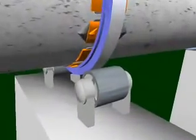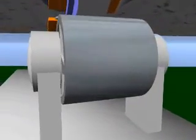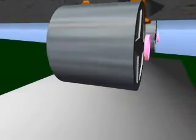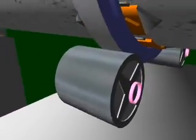As the kiln rotates, the tire rides on the rollers or trunnions, which provide the primary support for the tire and kiln shell. The trunnion shaft bearings are located inside the trunnion housing and they, in turn, support the trunnion rollers.